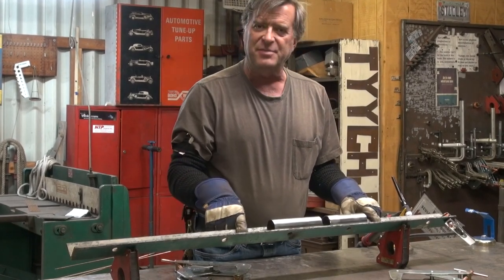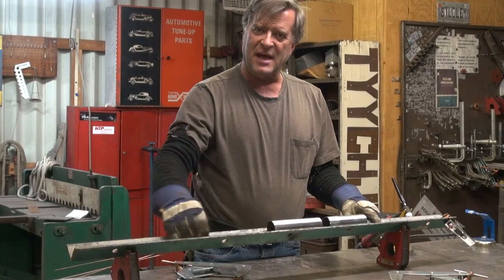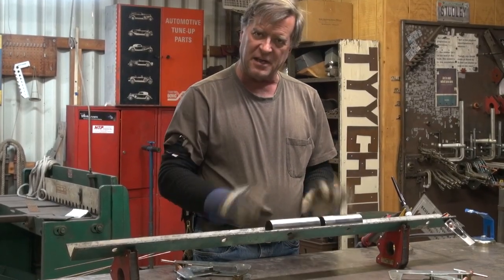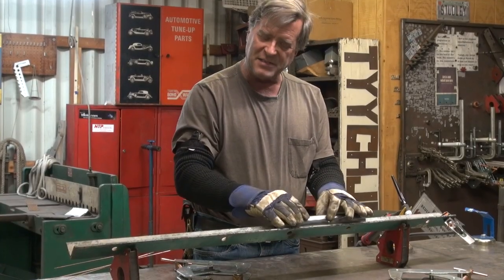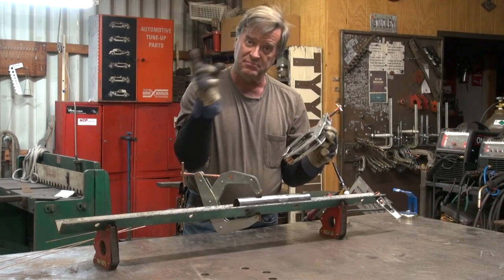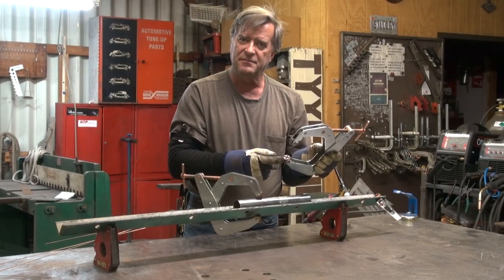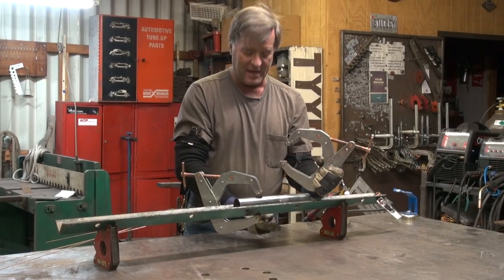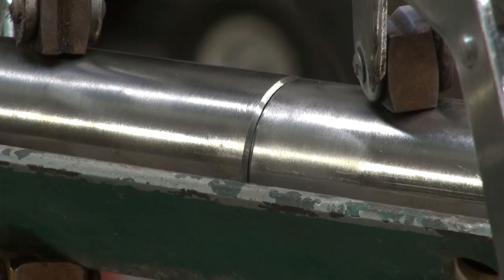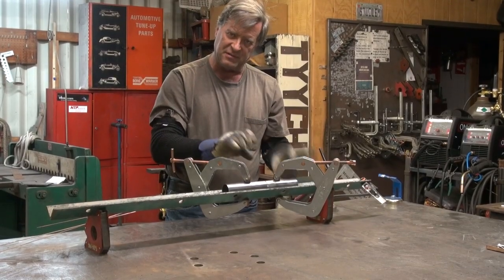All I use is a big piece of really thick-walled angle iron. You've got a nice 90-degree edge down inside here. If you're working with square tubing you can put it in that way and clamp it, or with pipe it cradles in there nice — everything butts up together, it all lines up. Then you just put a couple of clamps on it. These clamps are called Kant Twist — K-A-N-T-W-I-S-T. I really like them because of the little X on the bottom pad. You can get down inside there and get it right on the bottom edge of the angle iron, which helps lock everything in place. Now we've got a real nice joint, butted up tight with a nice little kerf where I can get a weld in and get some good penetration.